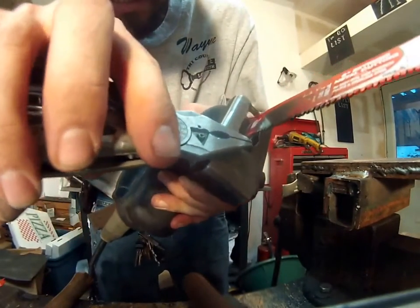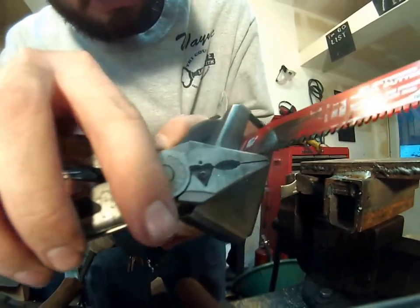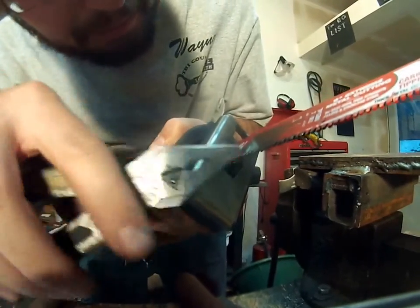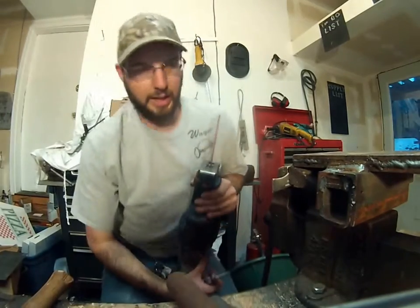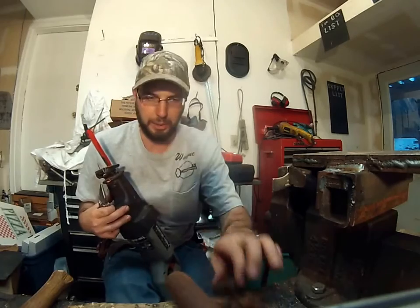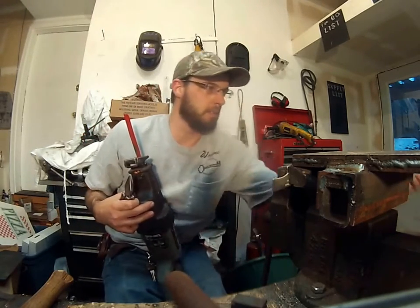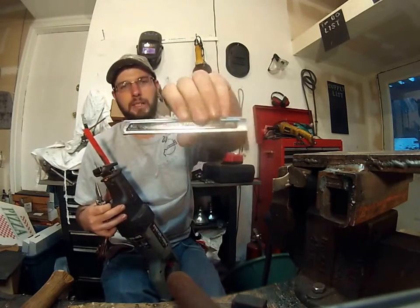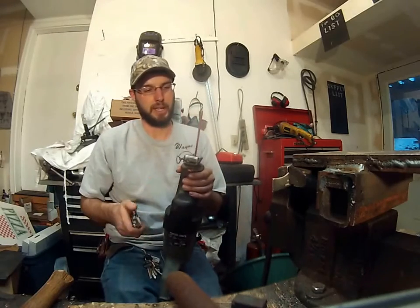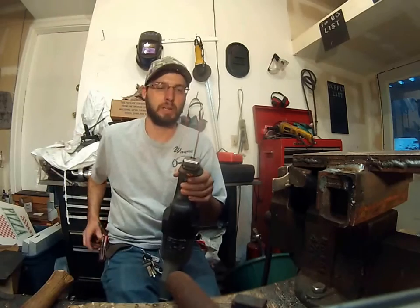And we're beginning to see some teeth starting to fail. So the carbide's getting jerked out of these. I would assume these two here do not have any carbide left on them. But look at all the stuff we cut. I mean, this is still the same blade that we cut wood with nails, 3/4 inch steel, our chrome vanadium wrench, cut through that, and just now it's starting to break down. So that's pretty impressive to me. We'll keep going with this thing and see what it can really do here.